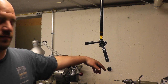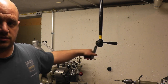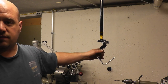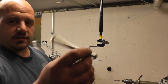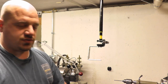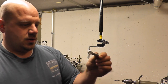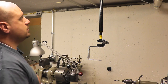Okay, so here's pretty much the finished product. The camera will sit here, and I have full movement to turn it, I have full movement to tilt it, and the thing I was more concerned about is I have room to level the camera when it's at an angle. Now, that locking screw, I found a long 3/8 bolt in my stash, and I just put a brass tip on it, and we'll use this for now, and maybe eventually I'll work up some sort of handle for it, probably just turn the outside of this down, and or even just cut it and thread it and Loctite a knob of some sort on it, but for right now, we'll just test it out with this.